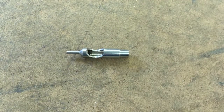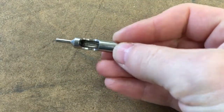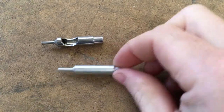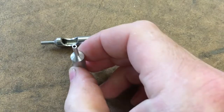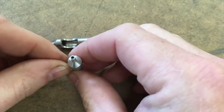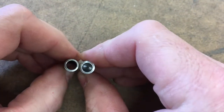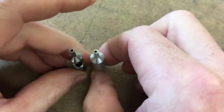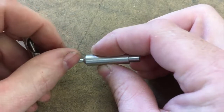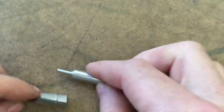These are 316 stainless. A lot of the cheap ones from China are now plastic and disposable, but even the metal ones are 304 stainless, and he said he's had some cheap ones that actually rusted in the autoclave. So first I did a dry run with aluminum just to make sure I had the proper tooling and dimensions right — I hadn't cut that groove yet, but I just didn't want to reset my lathe. I did this all with the four-jaw chuck, and I'm going to get a collet chuck because I'm not exactly centered on the tip — it was just hard to indicate that tiny thing in a four-jaw, especially aluminum that I'd cored out.